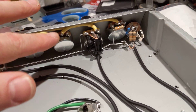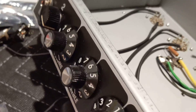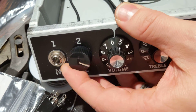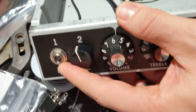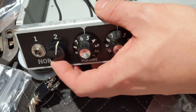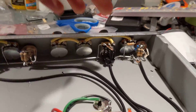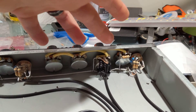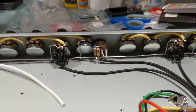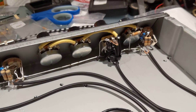You see some cloth wires, and here's a mid-pot. For this mid-pot, hopefully it's tasteful — I'm using this type of Fender knob. If I put another type of knob, the spacing is different and it will just look weird, so I went with that type. Remember that this is a Fender Dual Professional tone stack on the normal channel, and then here is a standard '65 vibrato tone stack with bright cap on/off channel.